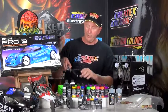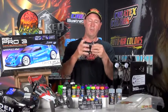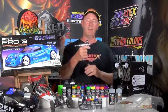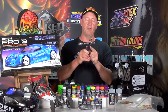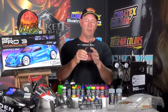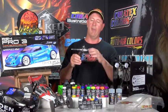First of all we've got the new CN. It's got a large handle and a trigger on the front — the trigger is on the front like a spray gun instead of on top. If you pull back you'll get air, then material; let it go and it stops. On the back you have an end stop: wind it out and the trigger travels further back giving more material; wind it in and you get less. It's a 0.35mm and it's capable of a hairline up to a three-quarter-inch fan pattern.